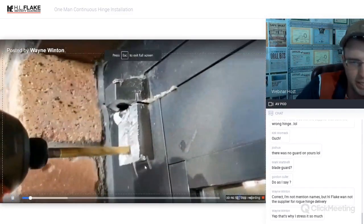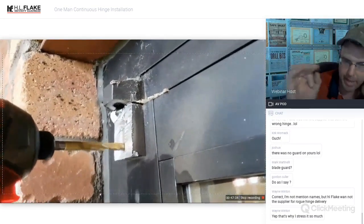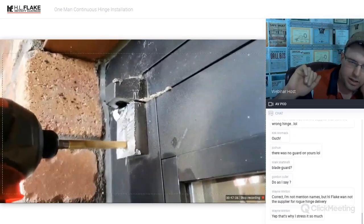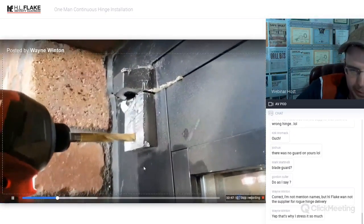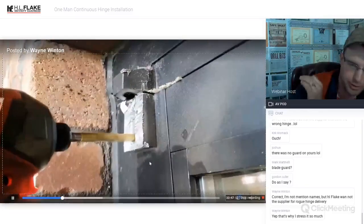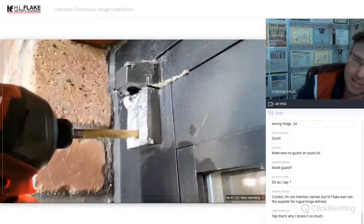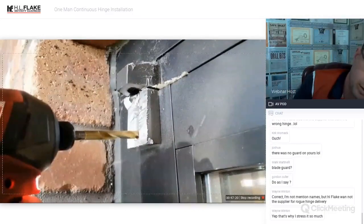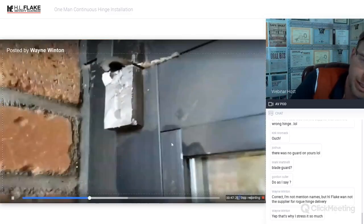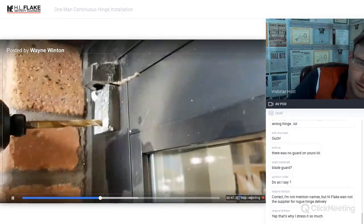So this is drilling the actual bolt out, okay? I'm just pecking it, and then you can use a smaller drill bit first. Maybe we're drilling through all the way on this particular one, but usually I'll use the larger drill bit, 3/8 drill bit, get a peck, get a center on that bolt, and then use a smaller hole to drill a pilot hole, and then follow it back out with the larger bit. See? It's looking good.